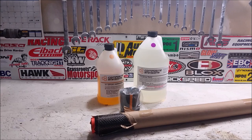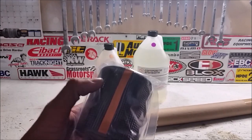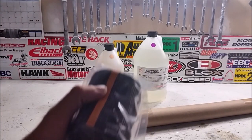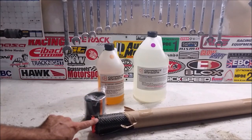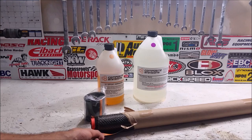The second stage is the actual materials themselves. We have a 5.7-ounce 2x2 twill weave of carbon fiber, an expandable tube of carbon fiber, and a two-part epoxy resin. Epoxy resin is essential for maximum strength and minimum weight — polyester resin is basically worthless. A nice detail from the manufacturer is that the roll has masking tape on the end to prevent frays, a stitch line on the linear yard, and again masking tape to avoid frays. Small details like this show that you're buying from a good manufacturer.